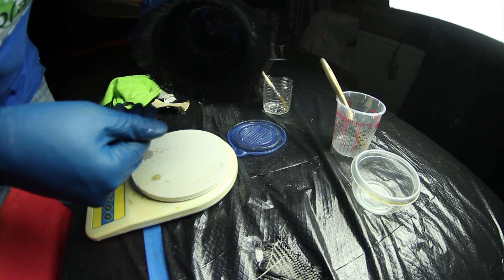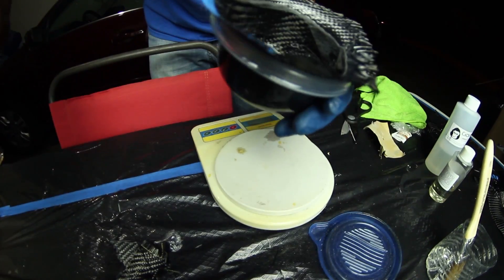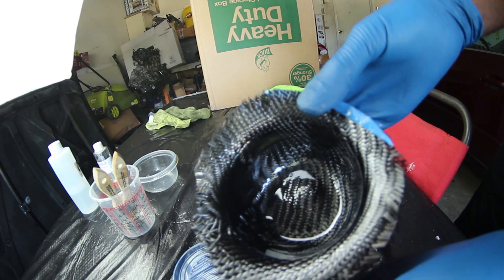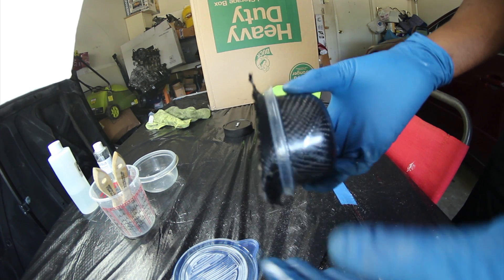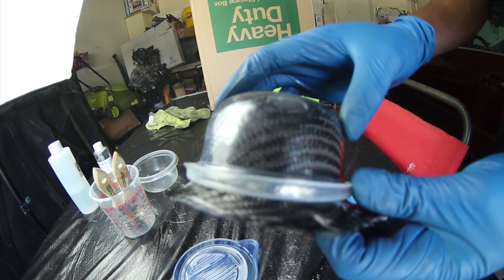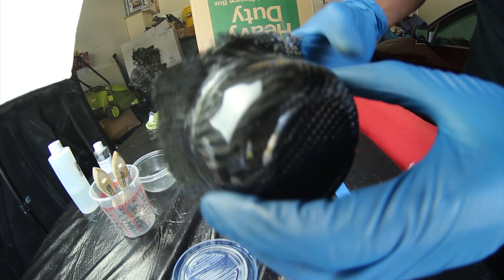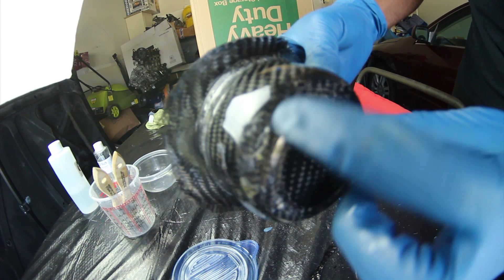Trying to get it coated around. You can see the light — I'll move you guys so you can see. Alright, it's morning. You can see that bottom part's got that nice epoxy deep wet look. The sides still kind of turned out lackluster, but it's okay. It's my first time making a bowl and it's more of a tool anyway. We've got some voiding right there and a little bit right there. This will definitely be something to use with vacuum infusion or vacuum bagging method. Let's go ahead and crack this off — see how it looks.